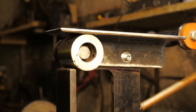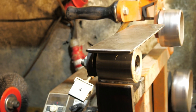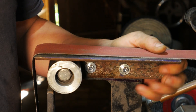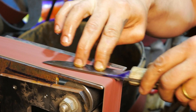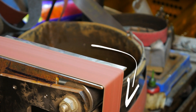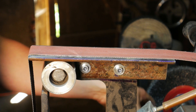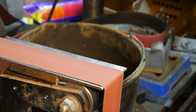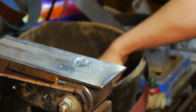Now that the waterfall platen is completely finished, I feel like addressing its pros and cons to give you an honest review of how it feels working with it. To start using the platen, you need to find the ideal tension of the belt. The sweet spot may vary with different types of belts. Finer grit belts generally work much better, as larger grain belts are much stiffer and will not bend at the steep angle as easily. This will result either in a much bigger radius or difficulties getting the belt running. The belt speed should also be reduced to about 20-30% of the usual steel grinding speed. Grinding on the platen also causes a significant amount of friction, which generates quite a lot of heat, so it should be used for around 10-20 minutes at best.